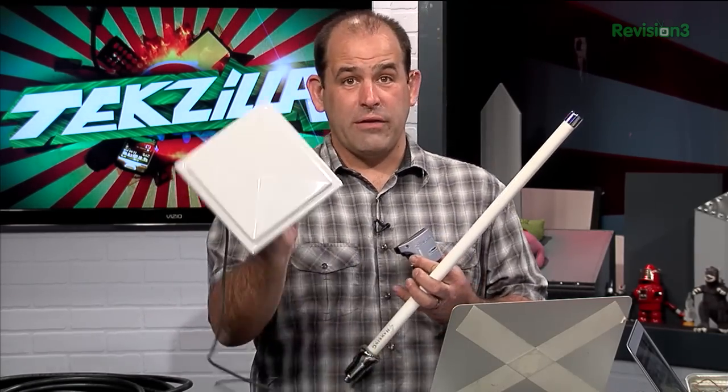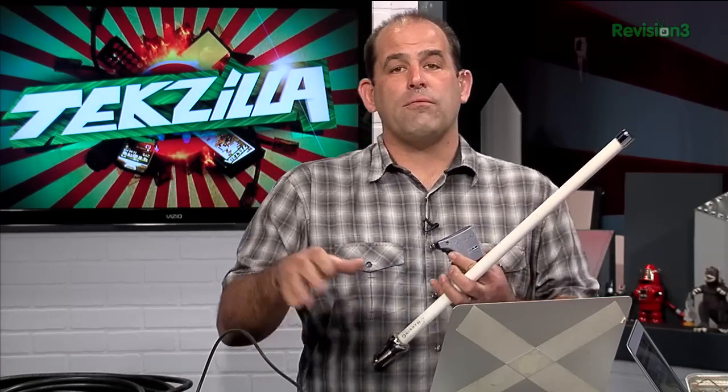They also have a 900 MHz non-line-of-sight wireless bridge system. Lower frequency does a better job penetrating walls. There are a lot of ways to skin this cat. A lot of folks obsess over adding wattage — like needing a 500 milliwatt booster — but increasing your receiver sensitivity is the number one thing for long-distance Wi-Fi, followed by getting your antenna right. Using a directional antenna will do far more for your signal than power boosters or higher wattage cards.